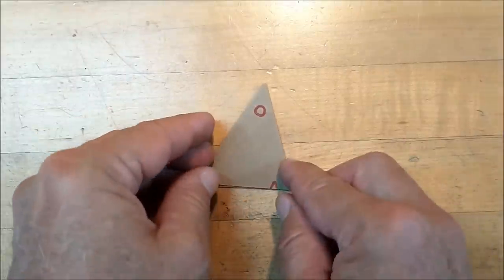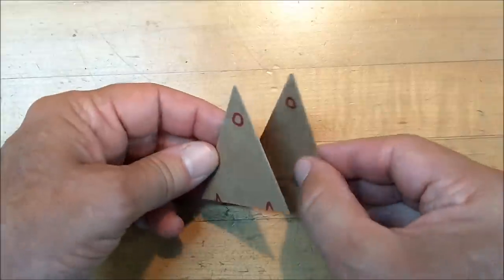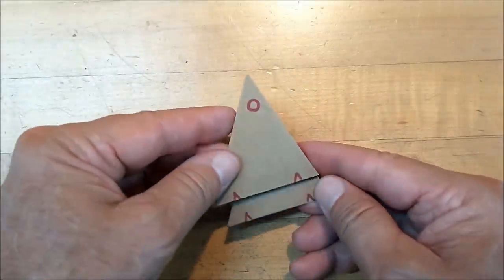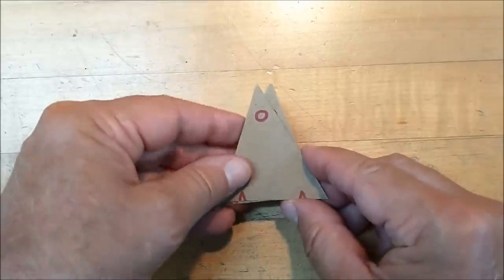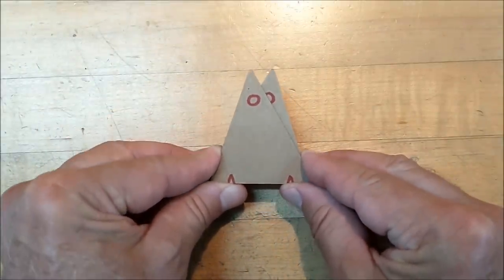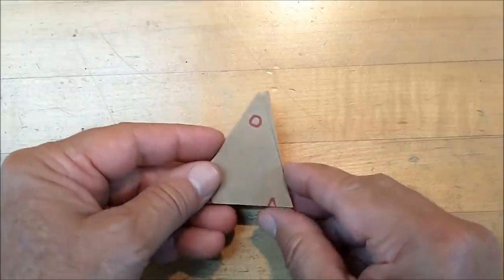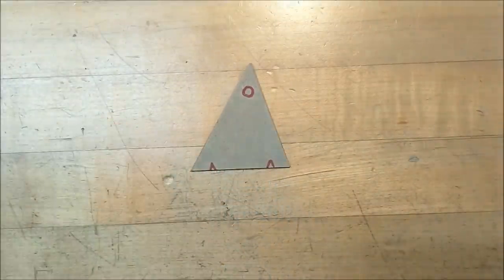Once you've indicated the hole on the tailstock, you want the headstock to be drilled accordingly, so that when they're installed, they line up. If you were to have the headstock on in the incorrect orientation, this way, and there is any error in the symmetry of the bottom to the top, that's what you'll get. So orientation is relatively critical. Okay, make sure that you drill it in line with the way it's going to be assembled on the model.